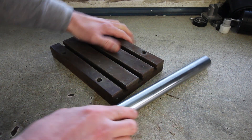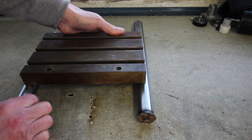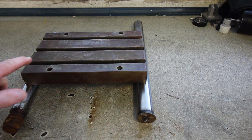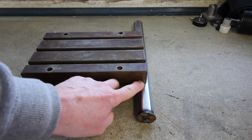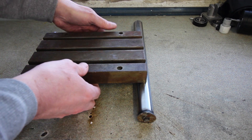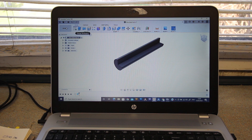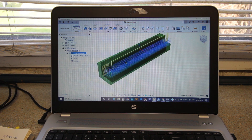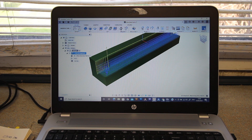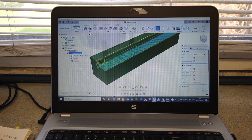This is what we're going to do: put a piece there and a piece there, but chop them down so the exact centre of this diameter is right on the corner of that piece, and then we're going to screw them on. That's what we're going to do - this slot is right to the centre point of the bar. So if I go to manufacture, I've got an adaptive strategy - let me just simulate that. It's a six mil cutter, and that's what it's going to do hopefully.